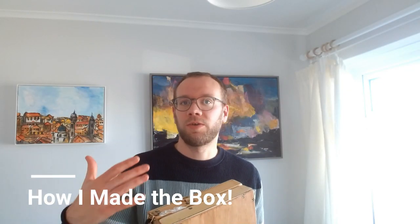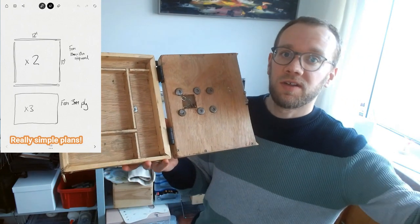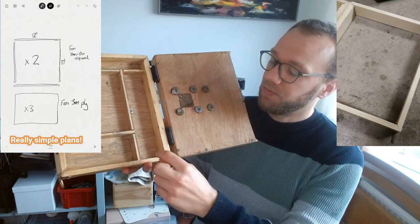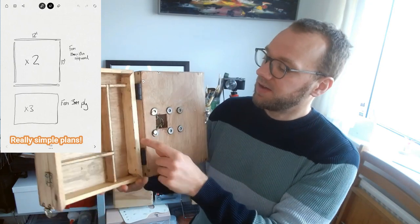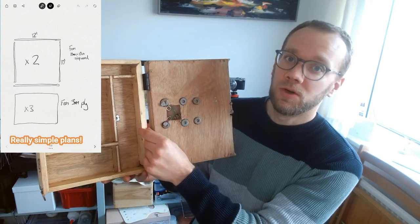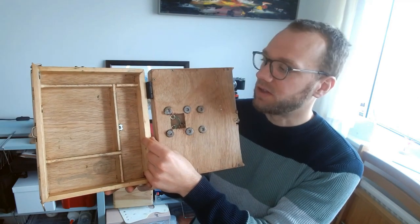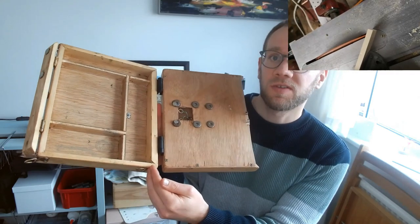So now's the good bit — I'm going to talk you through how I made it. I'm going to empty this out, and there's a link in the description to all the special parts I talk about, plus a list of the various types of wood and different bits and pieces I needed. So it starts off just as a 10-inch by 12-inch box — just a square, as you can see at the top as a work in progress. All of these edges are made with 10mm thick strip wood which is 8cm, except this end on both sides — because it holds the torque hinges and has to take a bit more strain — which is 16mm thick wood, about two-thirds of an inch give or take.